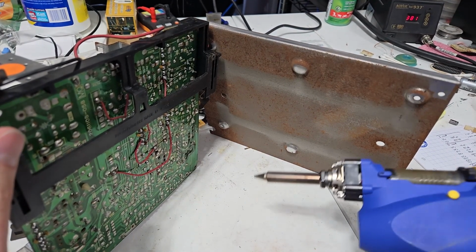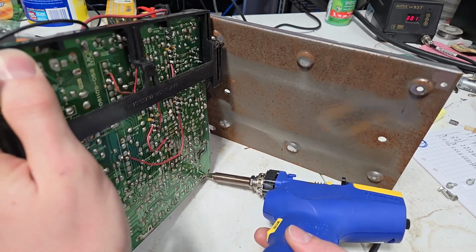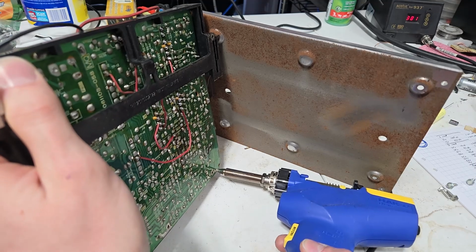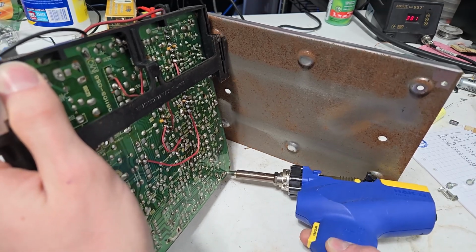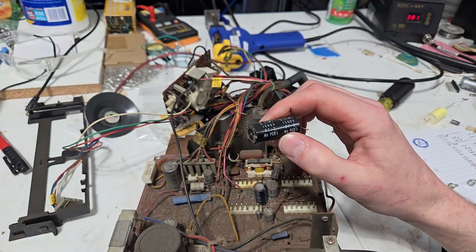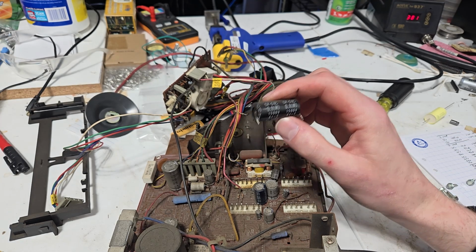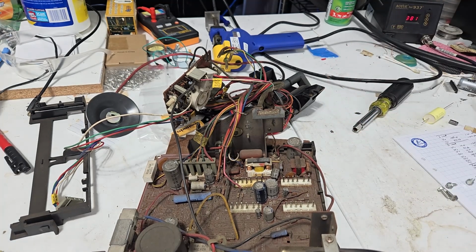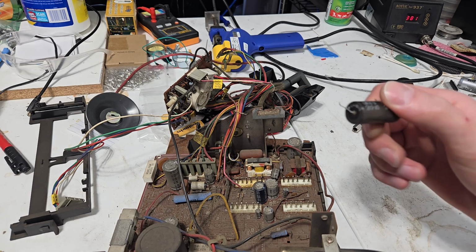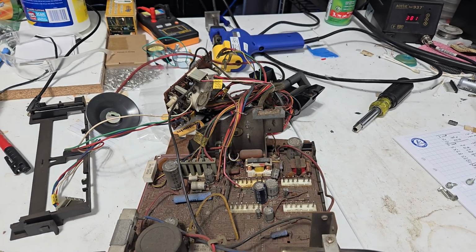There's some wire stuff going on here. It's kind of weird. 1500 volts. No PCBs. Well, you're on a PCB, so I guess deal with it. But yeah, apparently these can cause some sparky fun time internally as they dry out. I think this is a paper capacitor, so let's get rid of that and put this in.